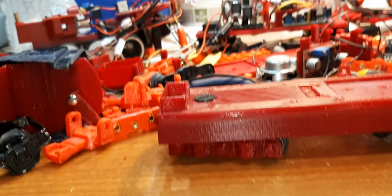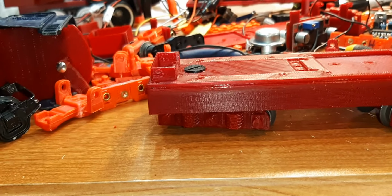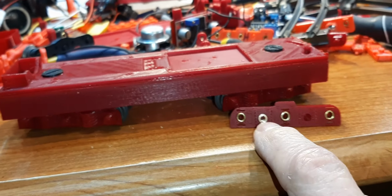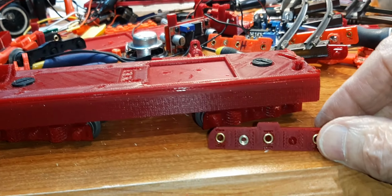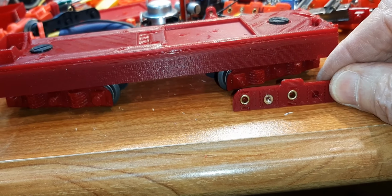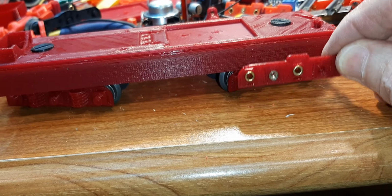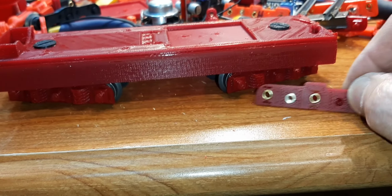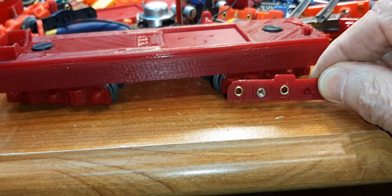So what I've done is I've pushed the axle point. If you notice here, the position for the axle is down low. So that's like when you have a pickup truck that rides too high and you want to lower the wheels, you bring the wheels up. Only in this case, we had a pickup truck that rides too low. We wanted to push the wheels down.